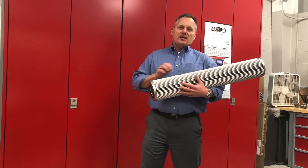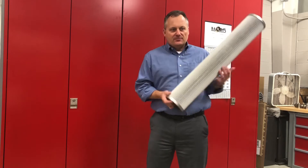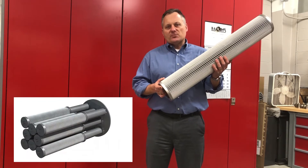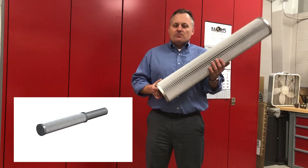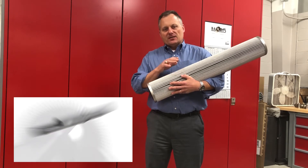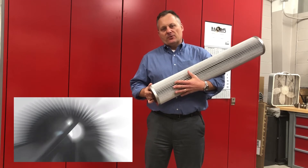Another thing that people will do is go ahead and open up the filter so it's easier to get through. The filter nozzle will make it a lot more open space so you can get those high viscosity fluids through. That works, but now trying to reach three micron, four micron, getting those six micron and smaller particles out — you're going in the wrong direction.